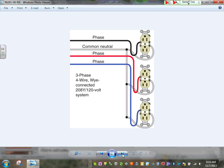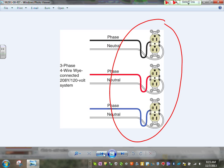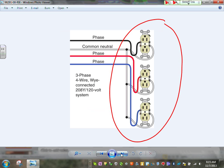What's the alternative? Look, this is how we wire the receptacle, guys. In the project that you guys have, your general purpose receptacles were wired in this way, multi-wire branch circuit. Your technology receptacles, Karen, that you wired, they were wired in this way. The technology receptacles, when you read, they ask for a neutral with every circuit. The general purpose receptacles were grouped together in a multi-wire branch circuit. Any comments, my friends? Any questions? Everybody knows a multi-wire branch circuit. You use a multi-wire branch circuit if harmonic is not an issue. If you have harmonic issues, like receptacles that can feed computers, just pull an extra neutral with every phase.